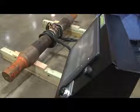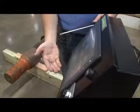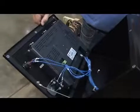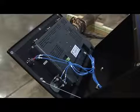In order to print the report, a USB connection is required from the printer to the rear side of the interface. To gain access to this USB connection, using a screwdriver, remove the 3 screws on top of the interface. This will allow the entire interface to fold down. Then, slowly fold down the interface to gain access to the rear side of the interface where the USB connection is located.